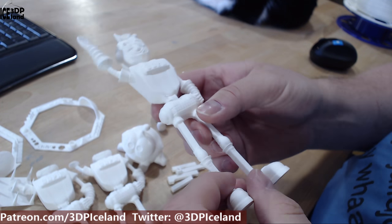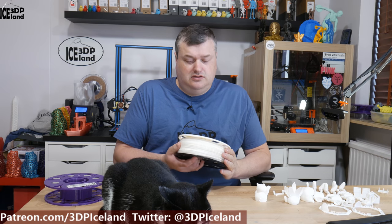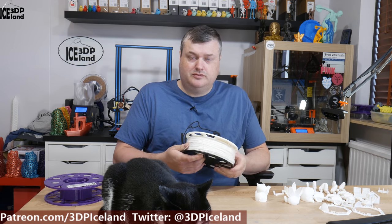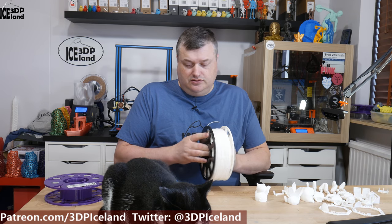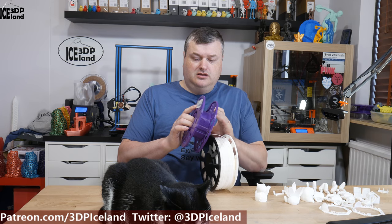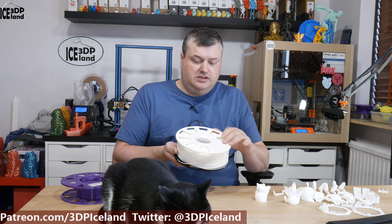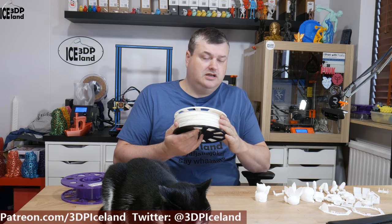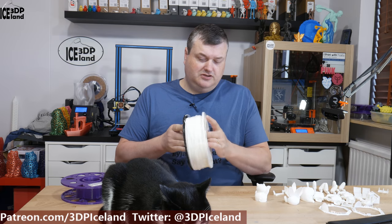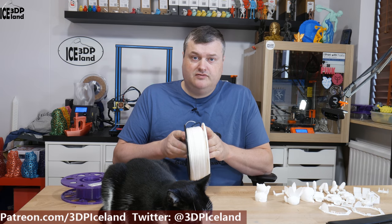So those were the prints I did — this was my quick review of the Keen Village Plastics PLA. It came in refill form with their own master spool clone, though it's not exactly like the master spool — it's a little bigger and the core size is a little different. You can fit these refills on a master spool but you can't fully close it, so it's quite cramped. I ended up printing the spool part in this material. I got two rolls, used a whole roll and a bit of the second, and I'm fairly happy with this filament — I had no stringing issues.